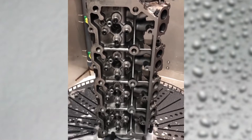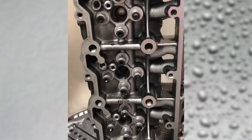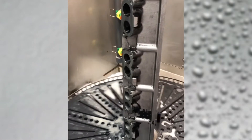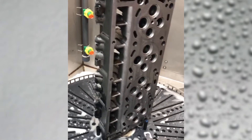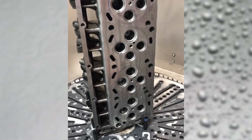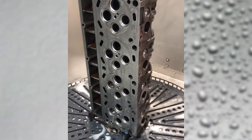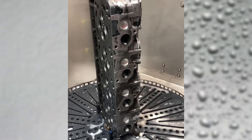After 20 minutes, this thing did really well. There's a lot of very complex, intricate detail work in here. This is a cast iron part, so we're not looking for polish — we're just looking for clean, and honestly paint prep. We don't have the correct abrasive for paint prep since this is a glass bead, but it's removing the enamel, whatever coating that is, plus all the corrosion and contaminants on the part. That's pretty impressive — 20 minutes, hands free, with an aqueous-based chemical plus the fine glass bead. Everyone here is shocked at how well this came out, so we're going to flip it, turn it, rerun it a couple times and then we'll be back.